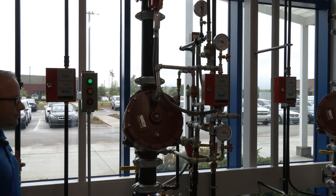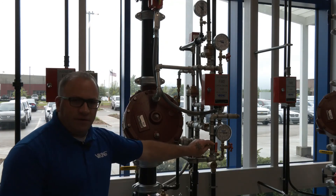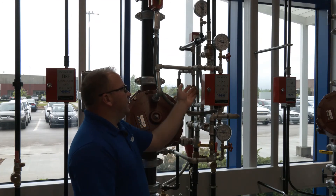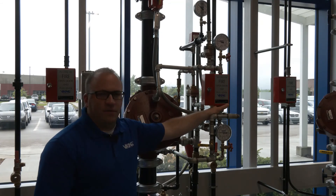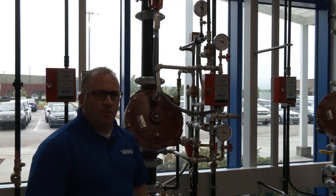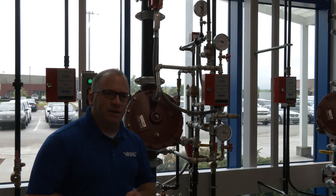We have a green panel. If we wanted to test the alarm, or the PS10 water flow switch, we're going to use our alarm test valve, which is located right here in the trim. When we open this valve, we're going to send water pressure up into the piping here and around to the PS10 switch that's located over here. The PS10 switch has a valve located on it, which is an alarm isolation valve. If we want to take that PS10 switch and move it up, or take that valve out of the picture, then it would be considered an uninterruptible location, which means that we wouldn't have the ability to turn off the PS10 switch.